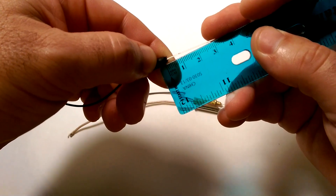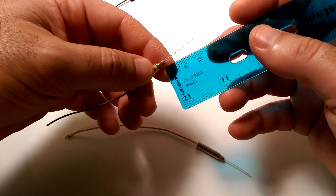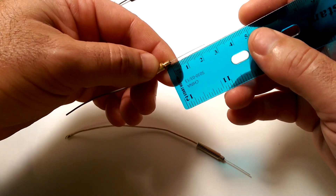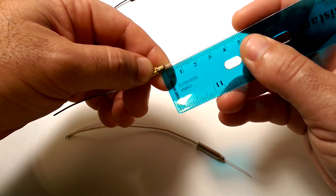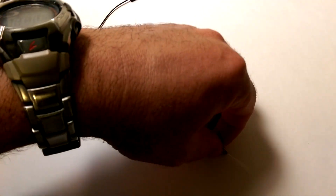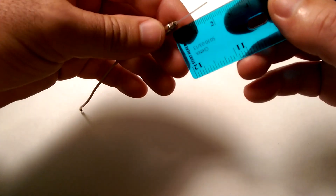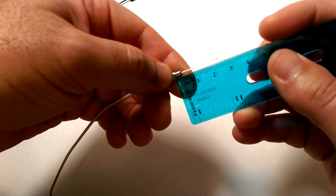I can actually see now why some of these antennas from old controllers didn't have good range. These two are actually not even 2.5cm long in the unshielded portion — this one's even shorter. It really does make a difference in reception. If they're the proper wavelength, the signal is going to travel correctly through the air and you'll have a better signal.